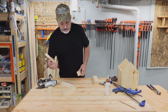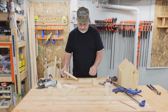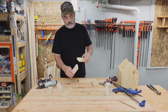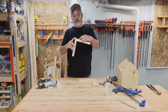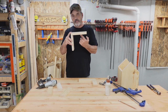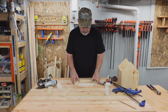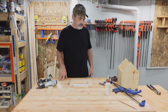I made an extra one here, and I'll show you. What I'm going to do with the extra one, because I've got to put them in together like this, and then the two 7 3/4 go together, and the two 7 inches. Because one side is going to hang over like this. So you'll have 7 3/4 here, and a 7 3/4, because the board's 3/4 and the piece is 7 inches. So we'll do it this way, and then I'll put that extra 7 in the middle just to hold this frame while I put a little bit of glue on it and a couple staples in it.